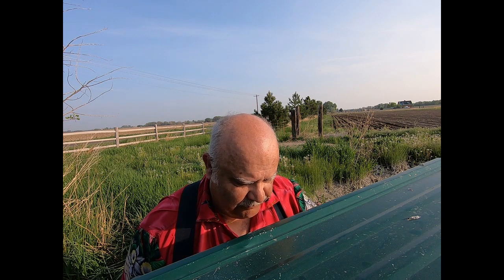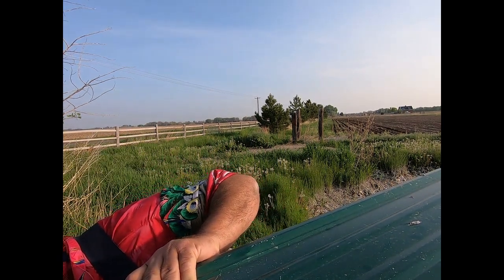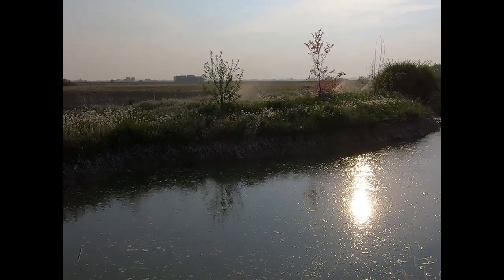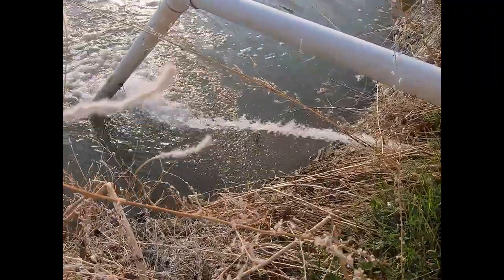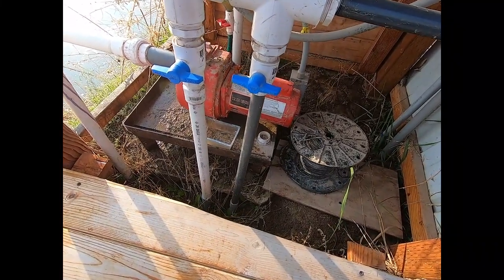Got a valve open. Sounds horrible as ever. By golly, we got some sprinkler action running out there. Let me shut this off back here. Let's see if that pump was picking it up. Yep, there it goes — it's got all the air out of it. I can tell because the sprinklers over there are running on the far side of the pond and down by the creek. The blowdown has a pretty good amount of force behind it. That water isn't dripping out of that pump any worse than it was prior to running it dry. So that's a good thing for the farm today.